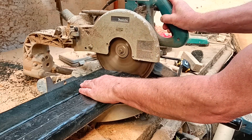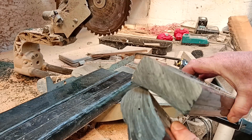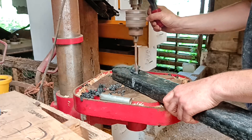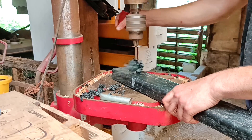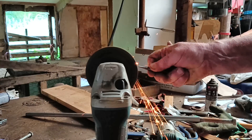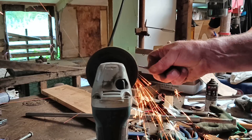But I'll tell you something — they are brilliant. Easy to cut, easy to drill, and maybe perfect for the job. In fact, I ground off a little from both sides of a spade bit so the holes fit the pegs snugly.